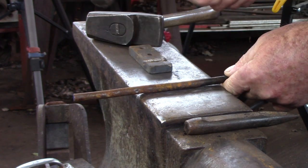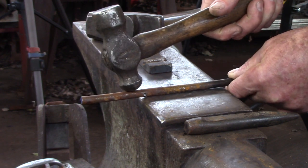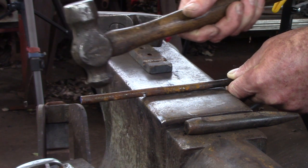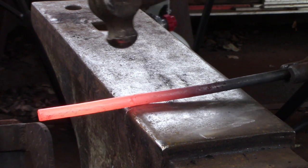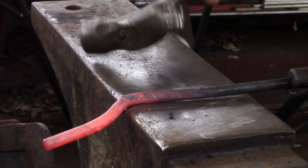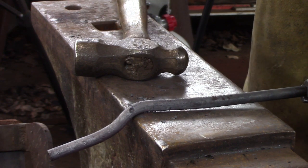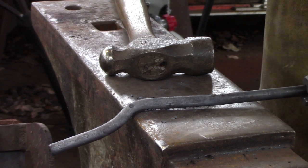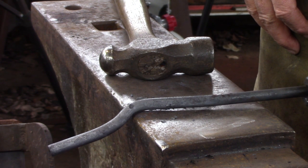As we're starting to make this bend, I'm going to use a small ball-peen hammer — my ball is a true ball, not one of the conical shaped ones, as that can lead to a bit of frustration. I'm going to drop that down about the thickness of the material out and initiate the bend for the hook, hoping that little bit remains straight because of inertia. Hopefully you can see that my center punch is now midpoint along the bend, which means it was pulled out as I was working — that's the creep at the edge of the anvil. We need to factor in how much creep when we do our bend for the hook. If you've got a different edge, or no edge and you're working over the bick, you may have to do your own test pieces.